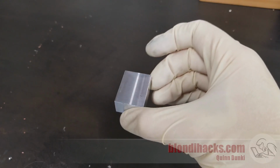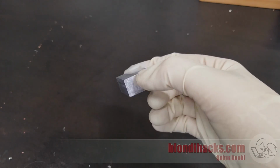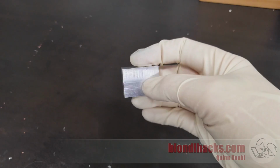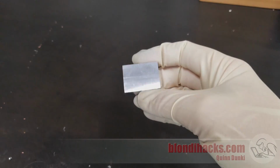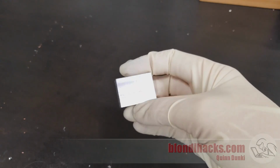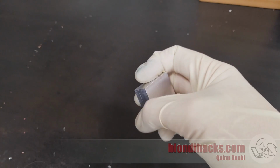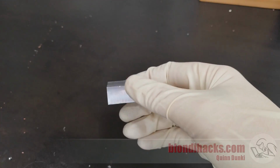And now we've got all 6 sides faced and everything is square and flat, and this part is ready to have features added to it. Now that wasn't the absolute fastest way to square up stock. You can, for example, combine those last couple of operations. If you're clever with how you position it in the vise, you can do the final facing and milling the ends at the same time, and so forth.